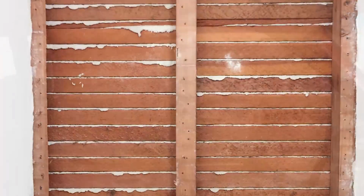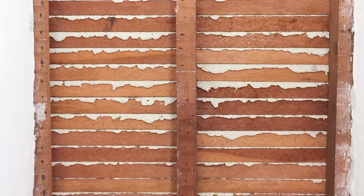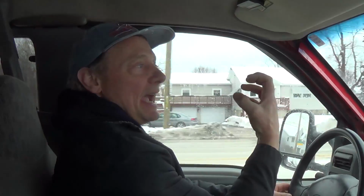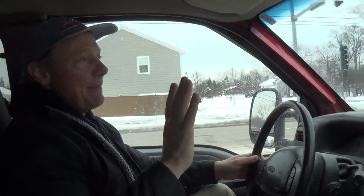You know, I've seen them do the plastering, and you'll see the plaster lath, where they keep a space in between all of the lath boards. They have the space in between them, and that's so the base coat can go in between those cracks and it grips from behind the wooden lath. So it's held on from behind, and then your plaster coat goes on top of that.